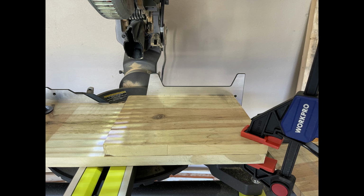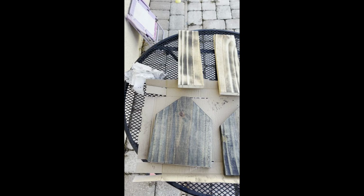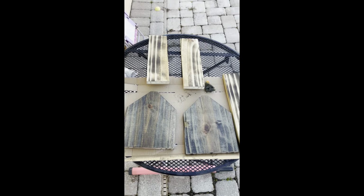I'll take the piece that I just cut and lay it back down on the board, and then I'm actually going to take the 2 end pieces that we did in the first part and line those up so I know where to cut, and this is going to be the base of the actual toolbox. In case that was confusing, I'll have it all listed down in the description box too.